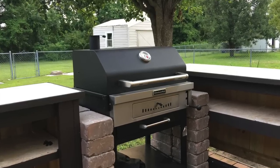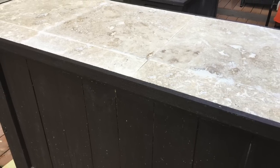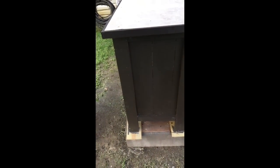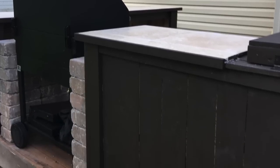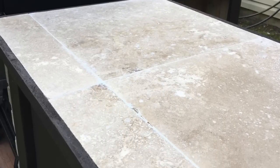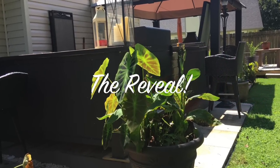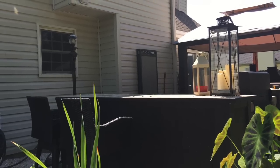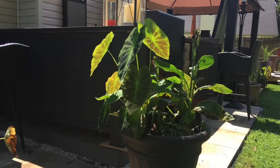Here the tiles have had an opportunity to settle and we're now trimming out the tile. The tile trim has been painted and we're moving on to the next step. At this point I still needed to add some grout. Our surfaces were 24 inches; we used 18-inch travertine tile — one complete tile and a second part had to be cut to fit. Tiles on the shelves are just sitting there; they're not attached with mastic or anything. We also made some outdoor solar lamps for the area, and now the reveal. We used some paving stones we already had and enclosed the area that would hold the bar stools, and we filled it in with pebbles and sand.